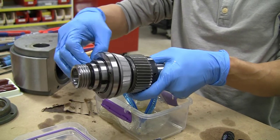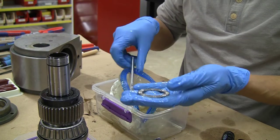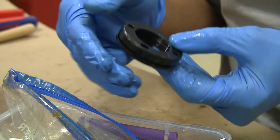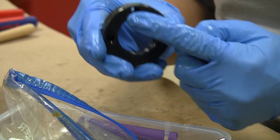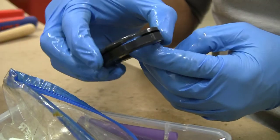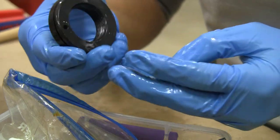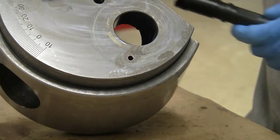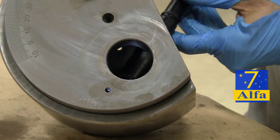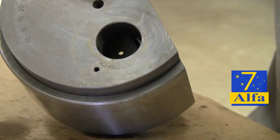After some clean out, the whole thing spins very freely and easily — no crunchiness at all. Here is the thrust bearing, and that too looks very nice and smooth, very clean; it spins easily. This is the locking washer in the back, officially called a split retaining nut — it is an M25 by 1.5. That split compresses down when the screw tightens, which probably grabs onto the threads and keeps the thing from backing out, maintaining the proper thrust preload. This is the hole for the mounting bracket for holding the worm shaft in place, secured with just a single screw — this is what keeps it from rotating and maintains the correct angle for engaging the worm shaft and the gear.